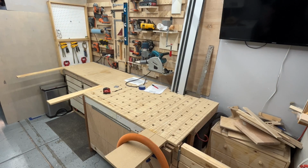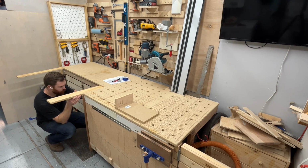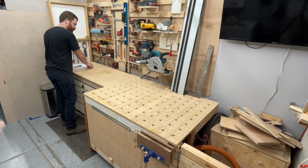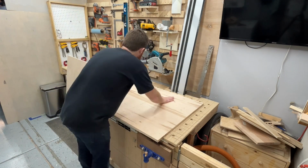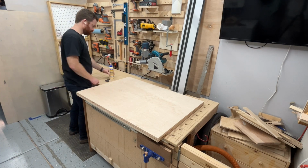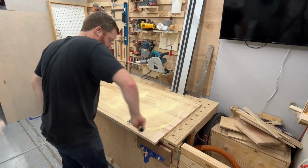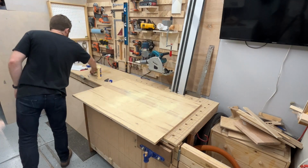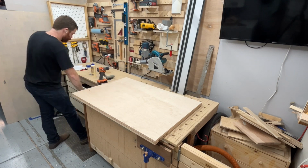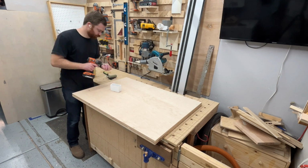Once the pieces are cut out, we take down the support brackets and then we will bring in those two smaller pieces to laminate together to create the slats. So the idea behind this is so that we have the standard plywood veneer on the sides of the slats. Then for the face of it, or what would be the plywood edges, we will edge band with 1.5" edge banding. So that will make all three sides with the maple veneer.